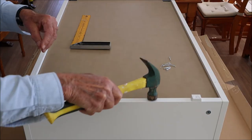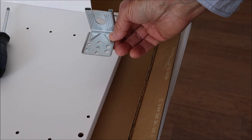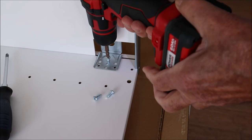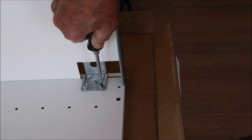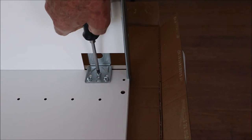These little brackets are to hang the cabinet on the rail that's attached to the wall. Just follow your instructions as to which holes to use. These little stout screws are the ones that normally go in here. Because they're going to take some weight, I always like to check with my ratchet that my screwdriver is putting enough tension on there. Then we'll just flip it over and do the other one.